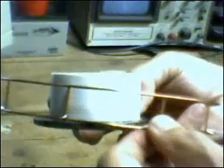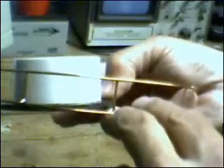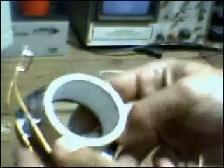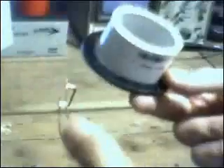What is becoming painfully apparent is that it's going to be very, very difficult to get the timing on this bobbin by bending the straight rails to create the slopes up and down around the perimeter of the bobbin. It needs to go up once at 0 degrees, down at 90 degrees, up at 180 degrees, down at 270 degrees, and then starts over again at 360.